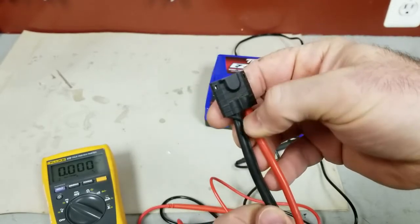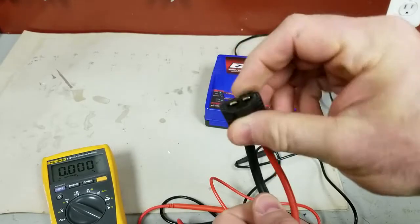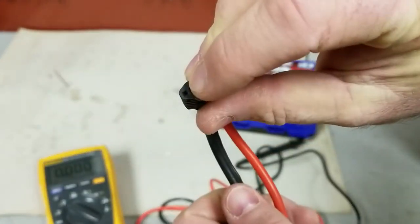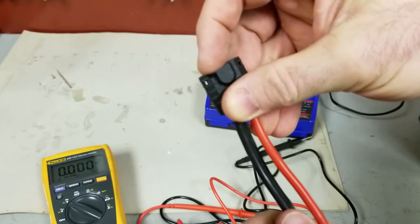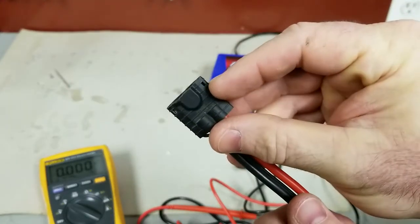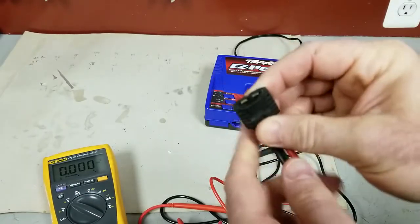Really, this has a built-in balance plug. It's this little thin wire right here next to the black negative wire, and it just goes up to this little thin metal plug right here on the very end — see that little one right there right where my finger is. That's really the balance plug. This is a 2s battery so it's got one; if it was a 3s battery there'd be another one over here on this side.